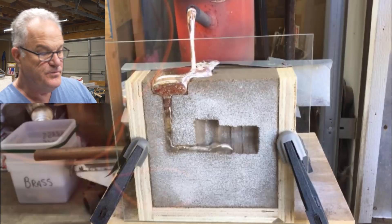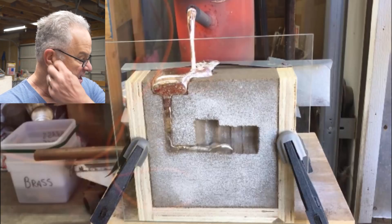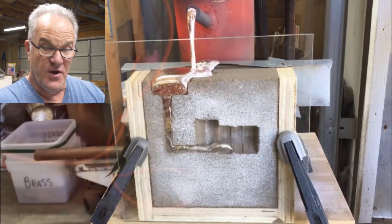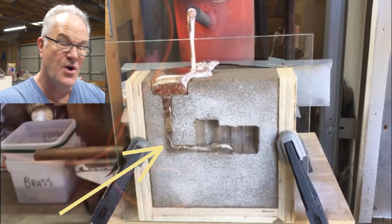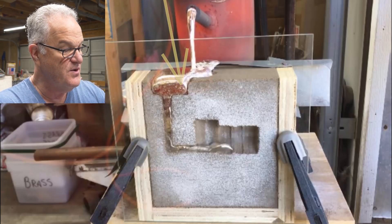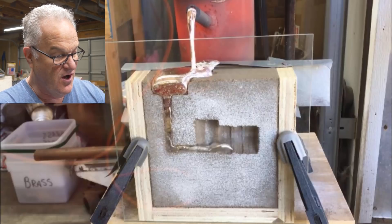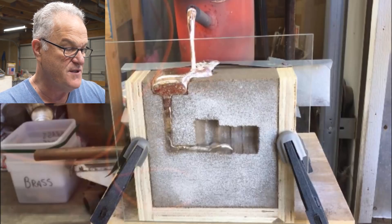Now we've hit the bottom of the sprue. We've already turned the corner and we're kind of across this cylindrical place here in the pattern. Notice that his sprue is completely full. He has no air entering the system up above — his ridge is full, the metal is full over the ridge, it's full coming into the sprue. He's not sucking any air down into this mold at all from the top. It's all full. He's got a completely pressurized system now. His metal has filled the sprue and the runner to this point.